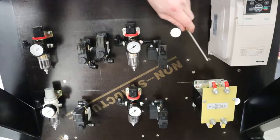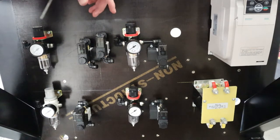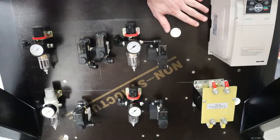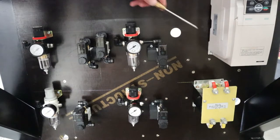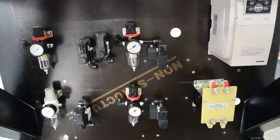Had a minor issue with the VFD here. This is an E550 TAC 2S, so it's two-phase or single-phase, not three-phase — 0055L, so it's a 5.5 kilowatt VFD for the 4.2 kilowatt spindle. I used the E500 manual to find the sizes, which is what I was told to do by the supplier. You can see these holes — there's one here, one there, one down here, and another over here. Those are the original mounting holes from the drawings I got for this VFD. It's a little bit smaller than what I was told, which is disappointing because I had to redo all the holes. I'm going to have to file out this hole here a little bit on the right line, just because I can't drill everything perfectly. But everything else on this whole board lines up, so I'm pretty happy about that.